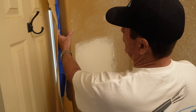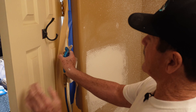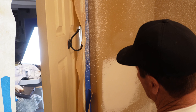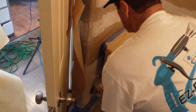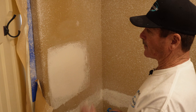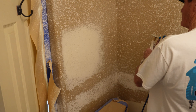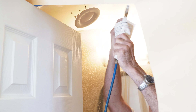The Easy Pro gun is great for these tight areas. I have a real narrow wall here that's adjacent to the door — it would be really hard to get a hopper up against this without banging on the door. With our gun I can get right into that corner. It's like an airbrush: it gets a real tight pattern with great quality and great consistency.